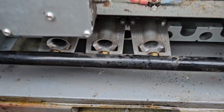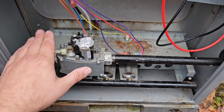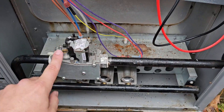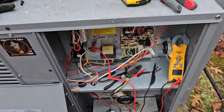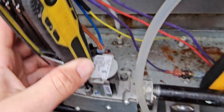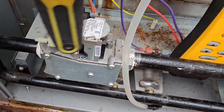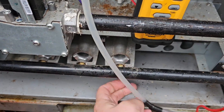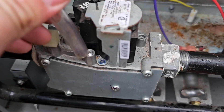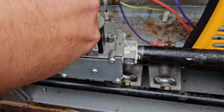The heat just went off and it didn't sound good, so we need to check the gas pressure to make sure it's set correctly. I'll get my manometer. Shut the gas off, open up the outlet screw, take the manometer, and put the tube on the outlet screw.